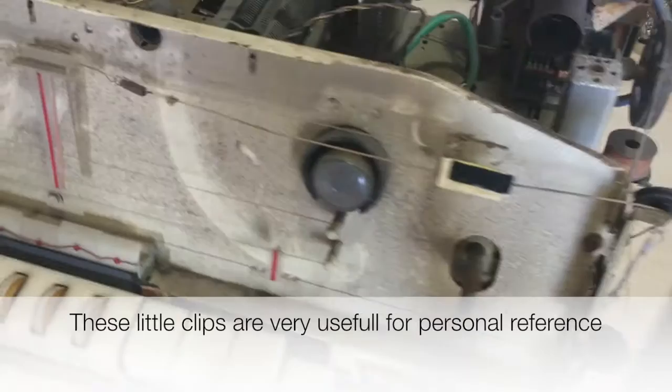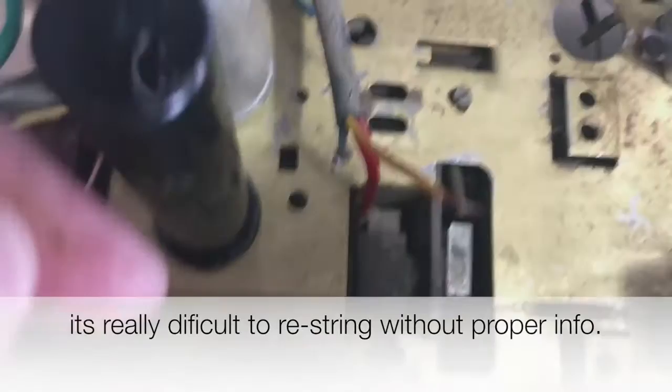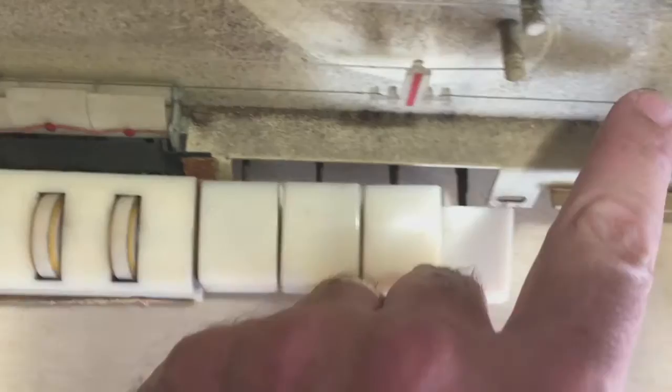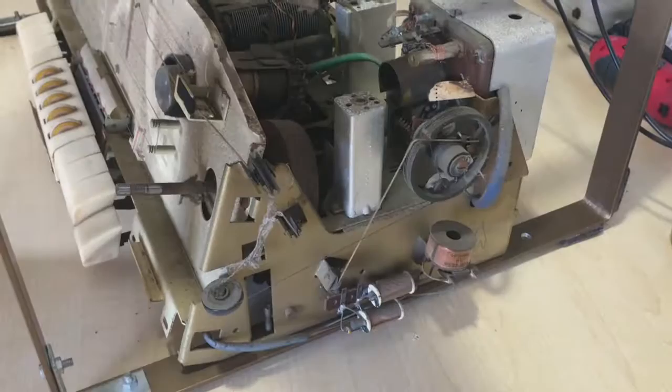To remove the FM dial cord, I turn the FM completely to the right - there's the dial there, the cap is fully meshed. Now what I need to do is go over the top here, and there is the spring. I'm going to remove this end - this will come out that way, through that one, around this one, around the front here, catches the little thing there, goes around that one there, that comes over the top, goes a full once around and then out there. Let me film the removal.